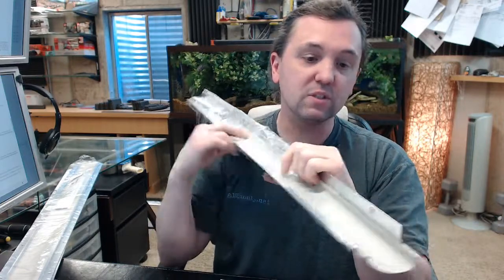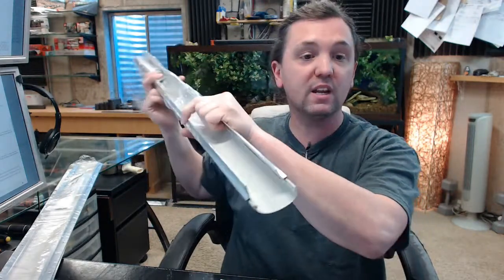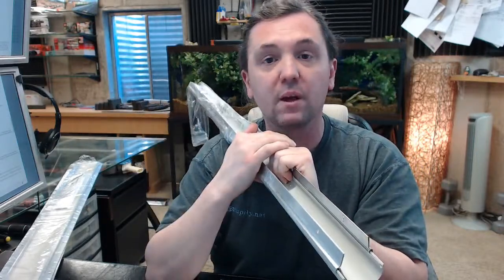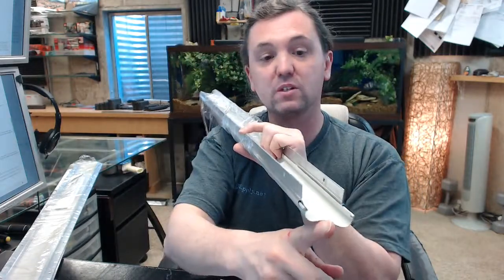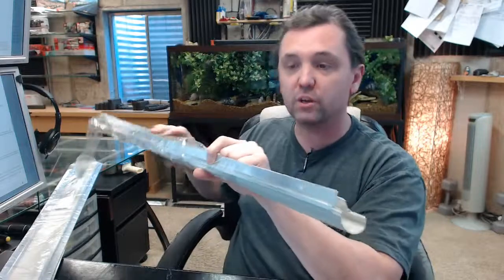This item has been sold to clients using it as a seal for an overhead door. You need to be sure your door is 1-3/4 inch thick. For overhead doors you might need a 12-foot length — in that case we can supply two 6-foot pieces but specifically request that the factory ships a 12-foot continuous length of the vinyl, which can generally be accommodated.